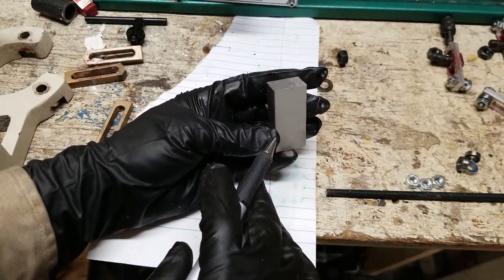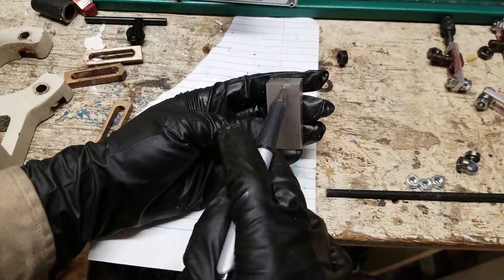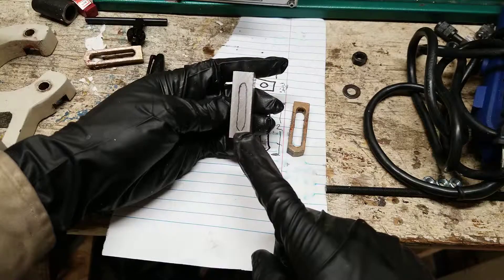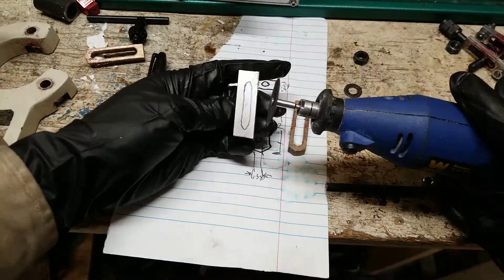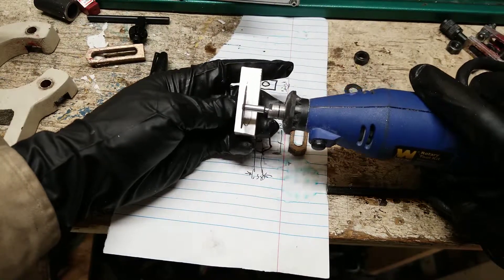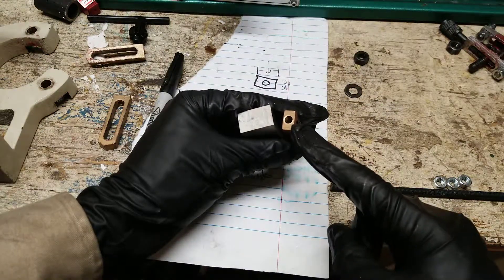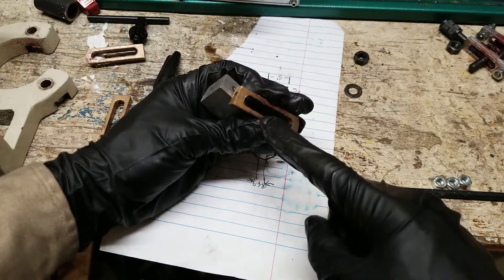When starting out with your rough piece of aluminum, you could either use a mill like I did, or cut it to the correct width with a reciprocating saw or similar tool. If you do not have a mill to create the slot feature, you could drill a bunch of holes along it and with the blade on your Dremel just cut along the edge to clean it up and you'll have a slot. To create the end hole, all you need is a drill and a drill bit to drill through it right through the end of the slot.